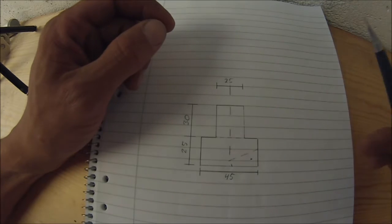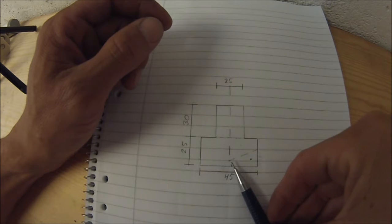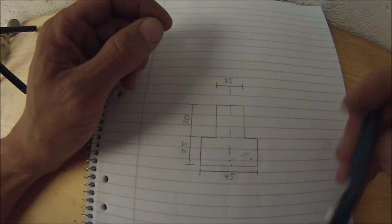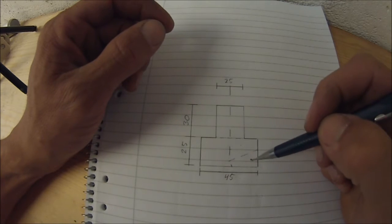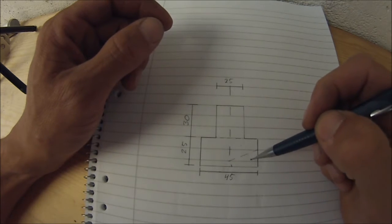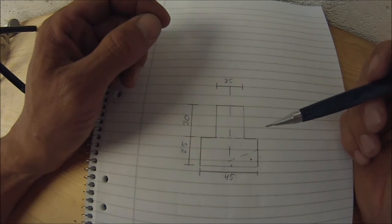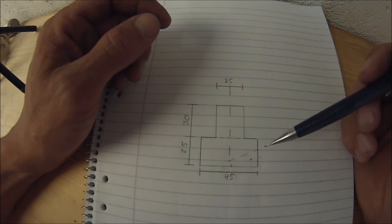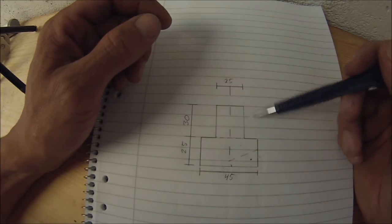And then I'm going to take an end mill and come in this way to mill a slot where my carbide tool will go. And I'm also going to have to drill and tap a hole in that. So nothing more to it. Let's get to it. And I'll start by cutting a piece of steel to use for it.